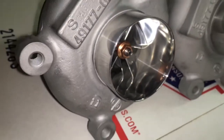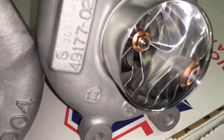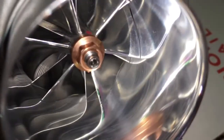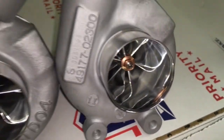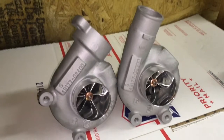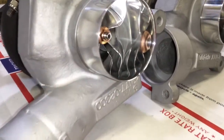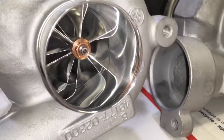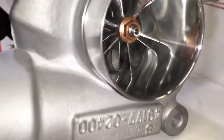The margin for error on this is extremely small. On one of them, I forgot to do that — it's a fraction of a millimeter — but in order to fix that microscopic eyesore, the compressor housing has to be re-machined back out and re-sleeved.